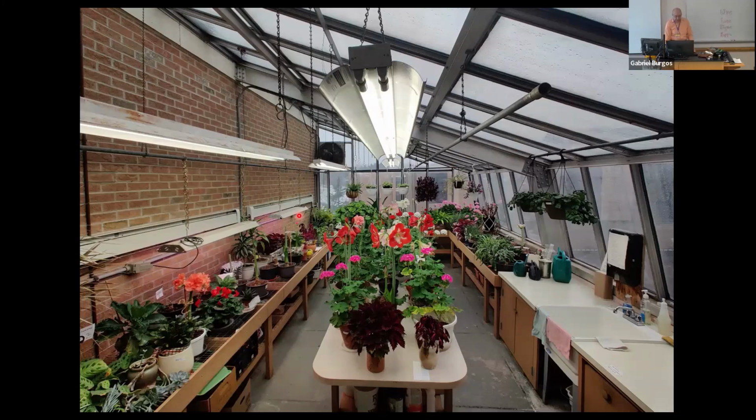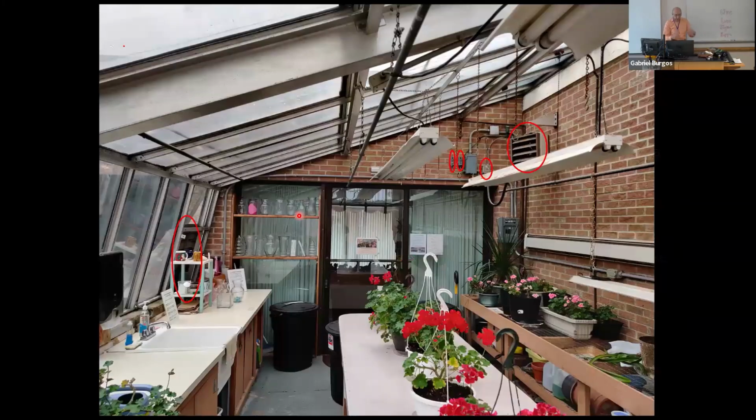Well, let me go to the other end of the room, and I'm looking back now. You can see the door into the hallway, and here in this corner is the intake for air that will be exhausted by that fan. And this also has louvers on there so that when the fan turns on, the air pressure opens them up and brings some air in. So during the summertime, when we've got lots and lots of solar heating, it won't take it below ambient, but at least it won't melt all your flower pots and so on.